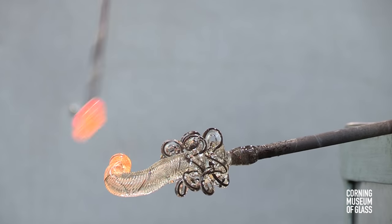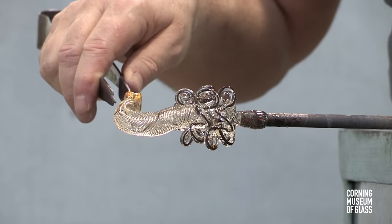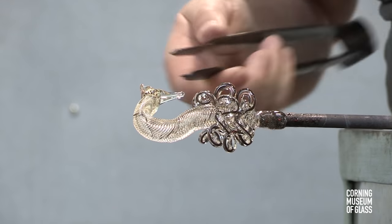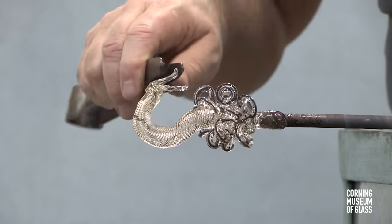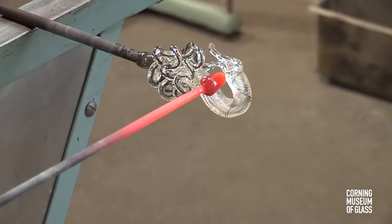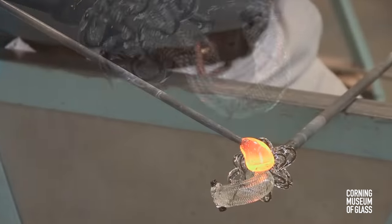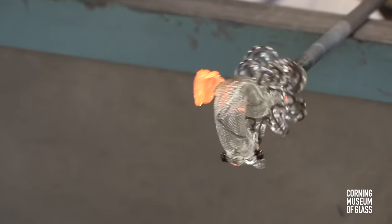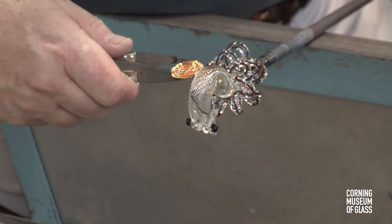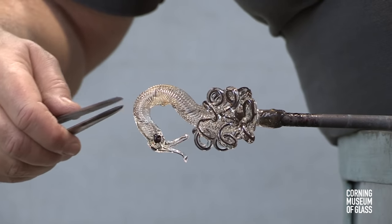A tiny bit of glass is added at the tip, cast off, and pincers are used to make a constriction, flatten the glass, make two grooves, and then at their tips pull the lips outward and down. Tiny bits of red glass are added for the eyes. A tiny bit of hot glass is added — this will become the first wing. Using a small pair of shears, tiny cuts are made to simulate the feathers. This is repeated for the second wing.